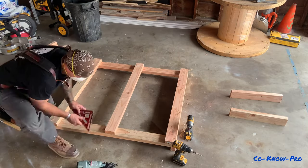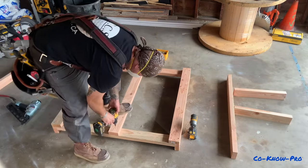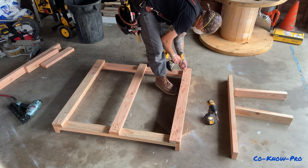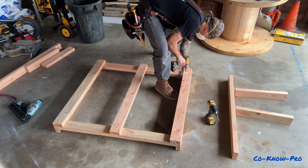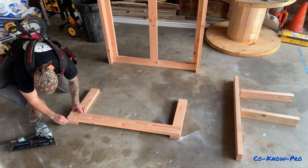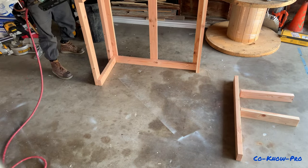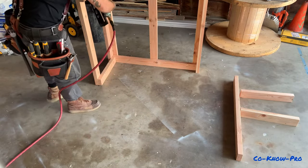Now I'm adding vertical pieces — I want three vertical pieces for the cedar siding to nail to so they don't bow in the future. If you just put the two outside corners and run your siding without that center piece, it's not going to be a solid product. So you have to add that vertical 2x4. Once we have all that locked together, we start making our corners — these are return pieces that attach to a vertical 2x4 and slide into the corner piece.